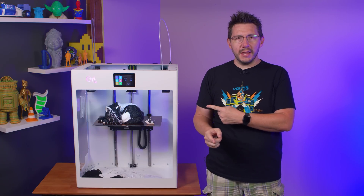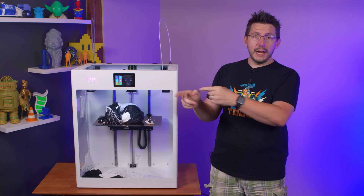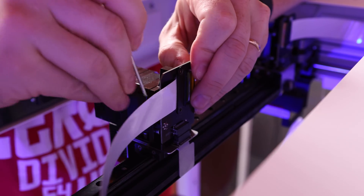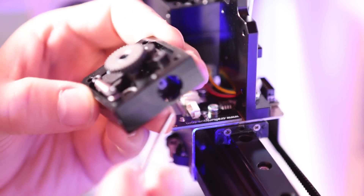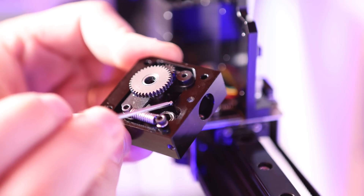Unfortunately for this machine right here next to me, the only thing that matters in that list is the warranty. Once the stream was over, I moved this machine into the side room and spent a number of days taking it apart, trying different things, learning the internals, and installing replacement parts. The first task was to get rid of the filament jam, which required taking apart the right extruder all the way down to nothing. Filament goes in, through the gears, and out to the nozzle. The jammed filament was right inside the gearbox. I got it out and started putting everything back together.